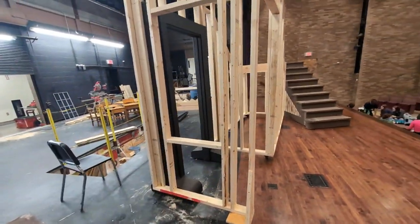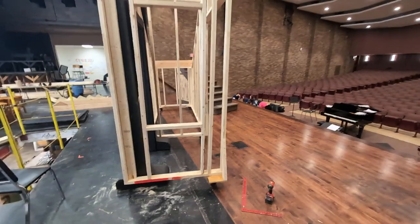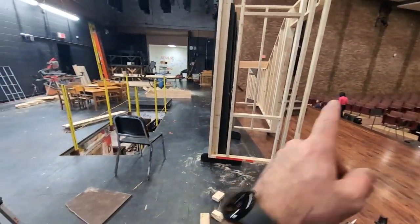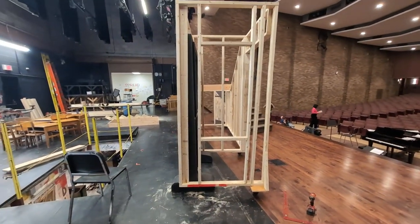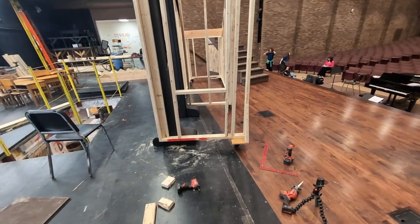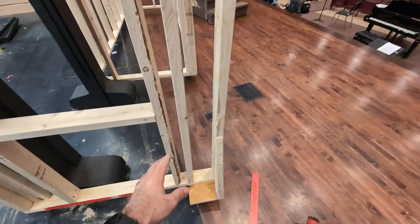We've got a big window hole in the middle of it. So it will be the plywood on this outside. It will be the Luan on this outside that holds it square. So sooner the better with that. I'm going to leave the window opening this size because I can throw that grid in at worst case. But if I end up having a few minutes, I'd like to build it so that it looks like a double hung sash. I can't go down below these gussets then with that sheet of plywood, but it won't be necessary to.